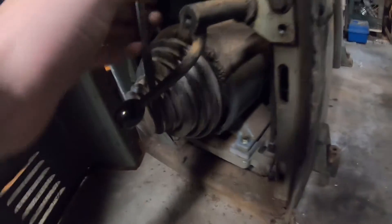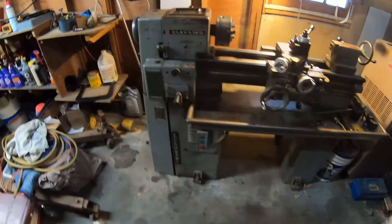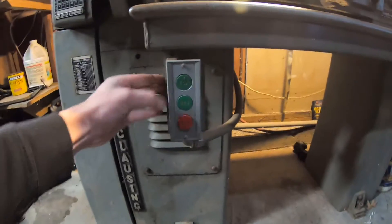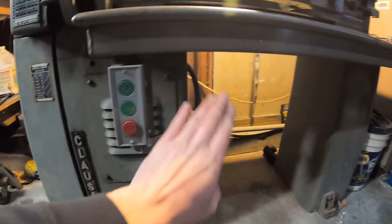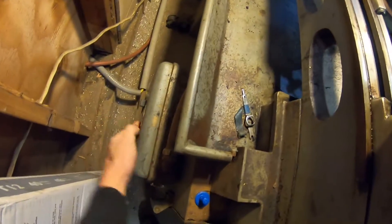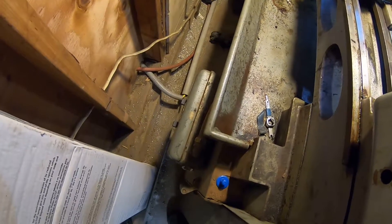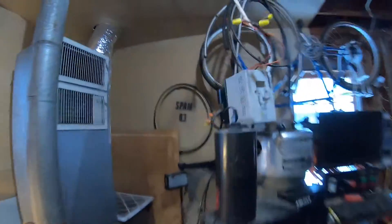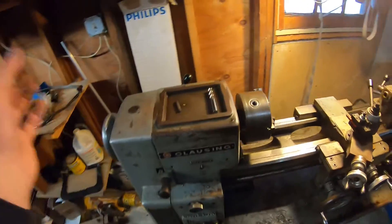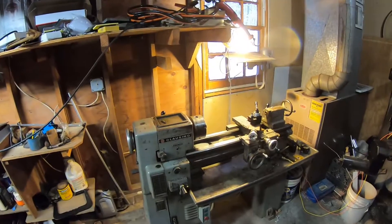All set — that's bolted back in tight. Now we've got to power it up and get it spinning. It's got this control box on the front — old school forward, reverse, stop — and the wiring goes to a larger control box on the back with the breakers. What I need to do is take this apart, find the 220 lines going directly to the motor, and jumper those over to our VFD so we can get this thing spinning temporarily until its own VFD comes in.